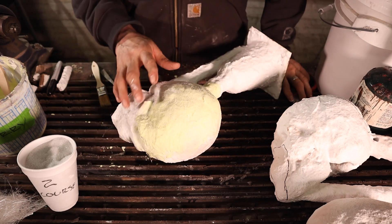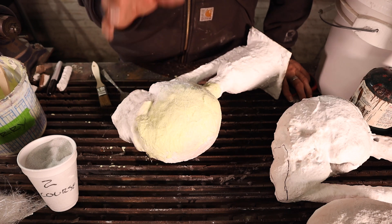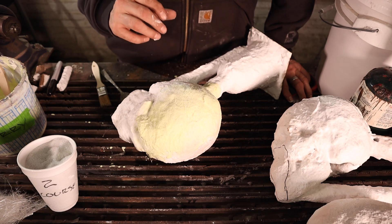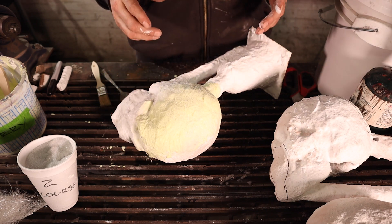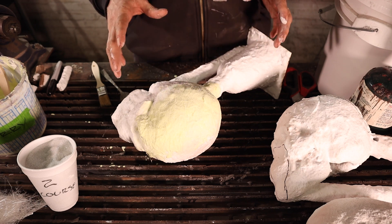The strongest patch is one that you just let air dry or put a fan on it, which will take a similar dry time as when you were originally dipping the shells. You can take a torch to them to accelerate it, but I would use a heat gun as opposed to a torch.